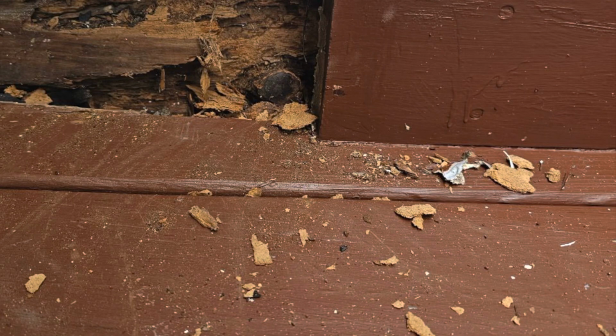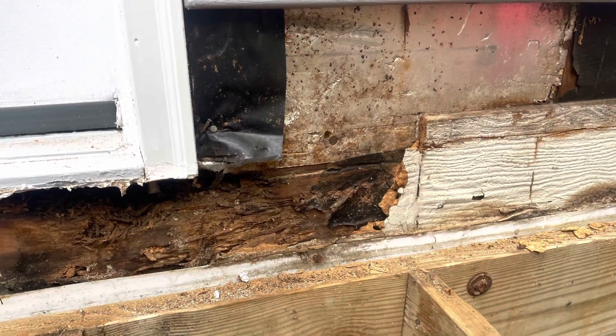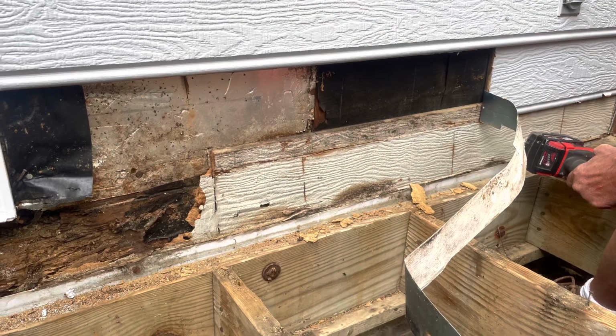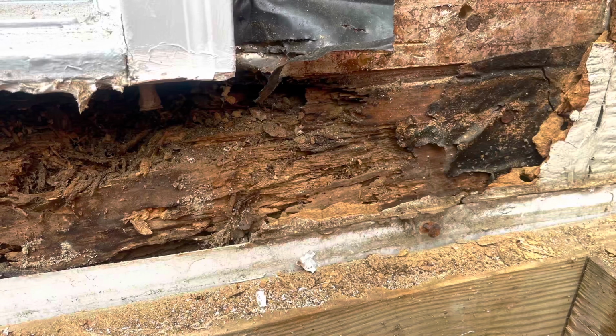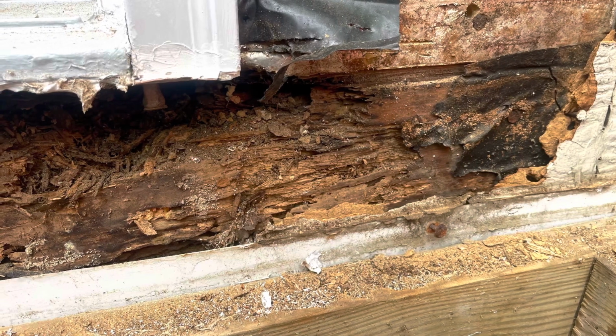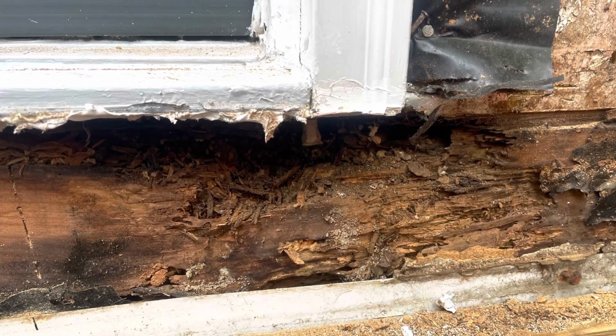The owner wanted us to replace one piece of Masonite siding on his outside wall near the deck. So when we pulled the one piece of siding off, we found that everything underneath was in poor condition, including the band board, and the flashing had been undermined by the chemicals in the treated lumber underneath.